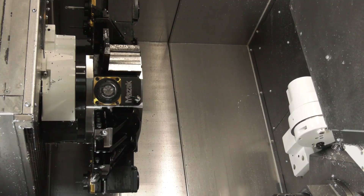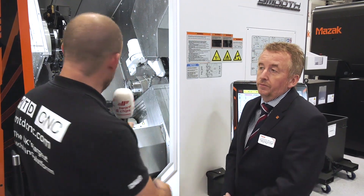You can use all 12 tools over an 8 or 10-inch chuck with good clearance. This machine has a 10-inch chuck on the front and an 8-inch on the back, with a collet chuck on the front — showing the versatility of the machine tool. What's the bar capacity? This particular model has 80 mm bar capacity, with a similar capacity to the second spindle so you can pass a component right through the machine.